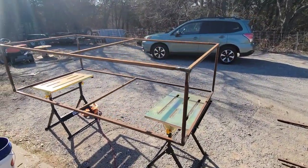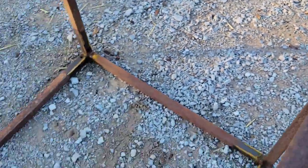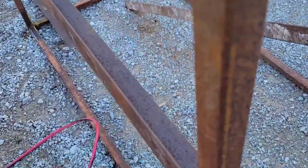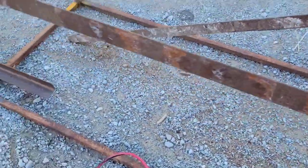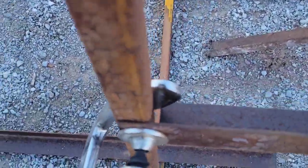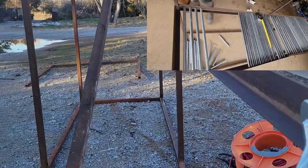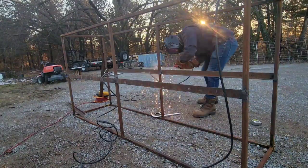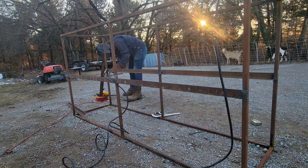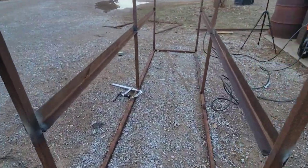Here's the complete frame on its side. Now it's been flipped over. I've attached a scrap piece of angle iron to the side using clamps, cut out gaps where the one-by-one inch steel can fit in between to have the vertical side of the angle iron flush along the side. This angle iron will be used to hold the conduit, which will be the bottom grating of the whole bin. I used two eight-foot pieces of angle iron on either side and then put a two-foot section on the wide side where those gaps are.